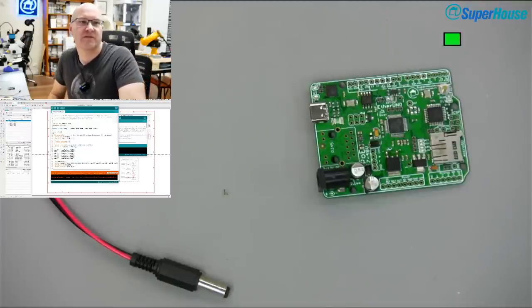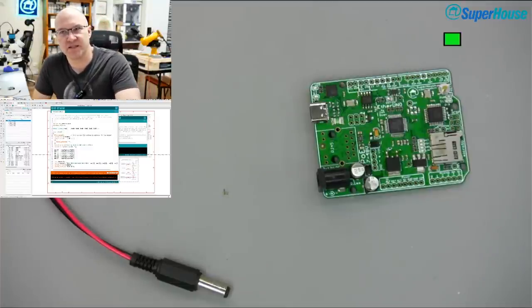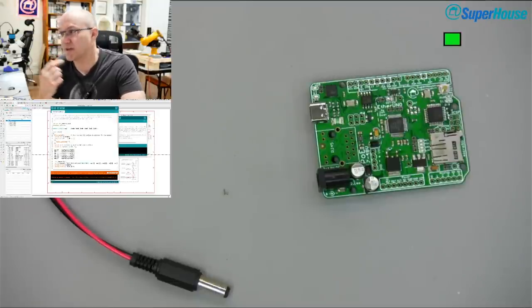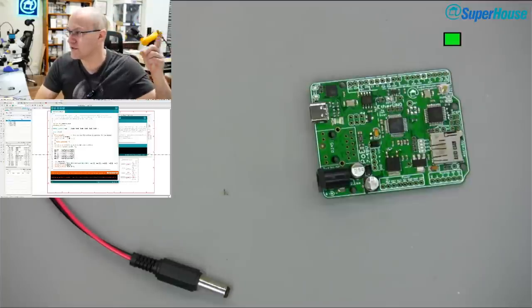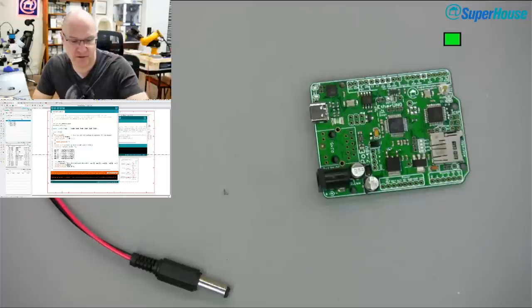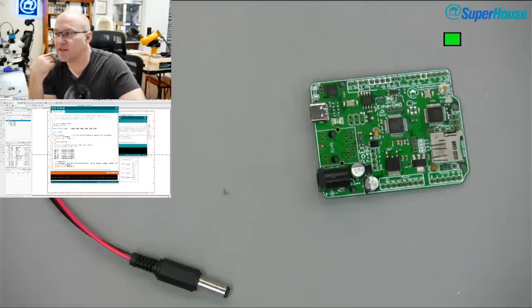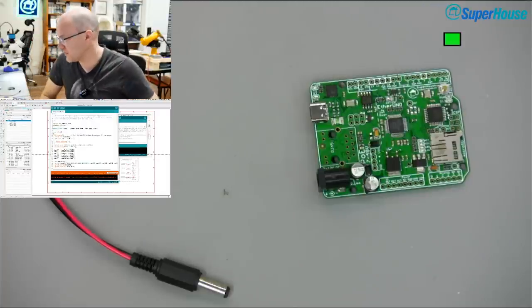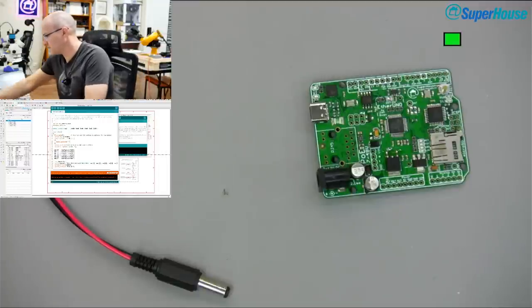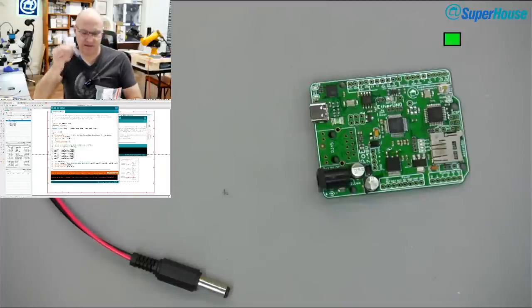And in relation to Station 240's thing about 24-hour solder paste, there are a few different types of solder paste. You can get solder paste that is called thermally stable, which means you don't need to keep it refrigerated. I have a little bar fridge through that white door, which goes through to a little bathroom, and you would have seen that if you saw the lab tour a couple of live streams ago. There is a bar fridge in there, and I have a plastic container where I keep solder paste. The solder paste that I used is not thermally stable solder paste.